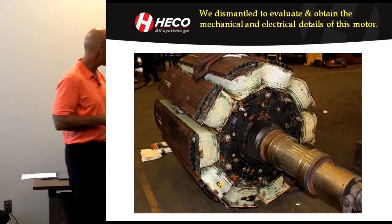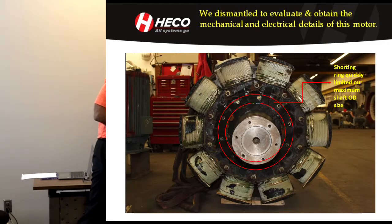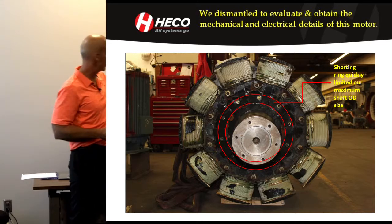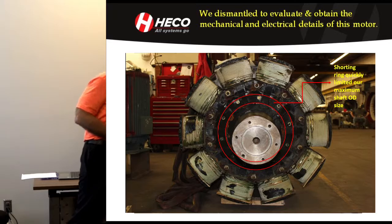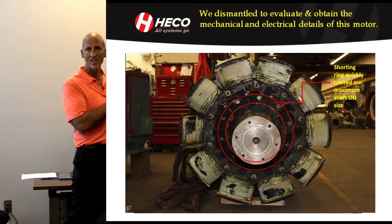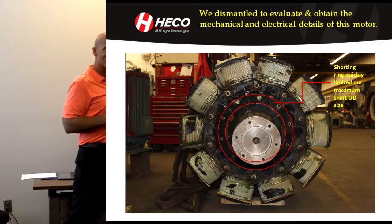So the first thing that I noticed, and I don't know if you noticed in the picture, was that the rotor didn't have a shorting ring out here. What it had was a shorting ring down here, and it was unique. I've only seen this 2 times in 38 years of being in the industry. Yeah, my dad's been in it longer than I have.